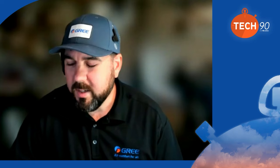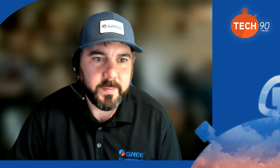All right. So Drew says, is it 0.4 to 0.6 inches of water column or 0.04 to 0.06? It is 0.4 to 0.6. That is a really good question. And it's important to see that difference, because that's a big difference between 0.4 and 0.04. Sometimes you guys ask me these questions, and I deal with it day in and day out, and I'm constantly looking at those charts. But Drew, I'm going to be honest with you, I still went and looked at it again, going, that 0.4 point.